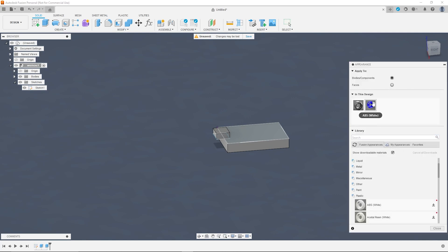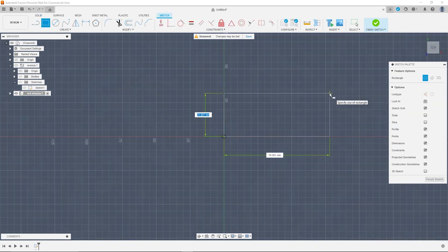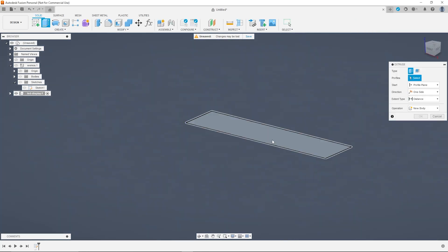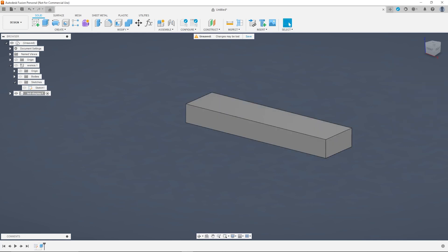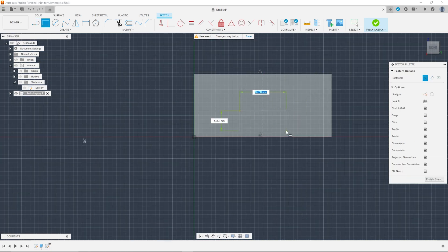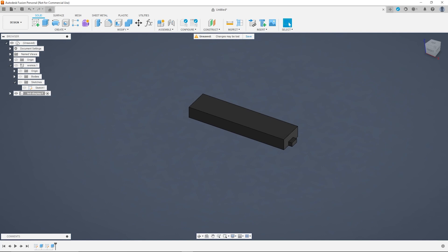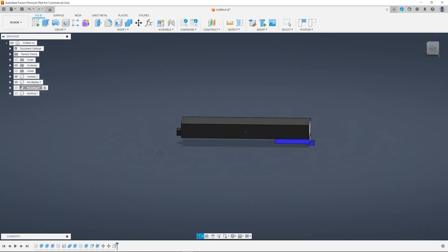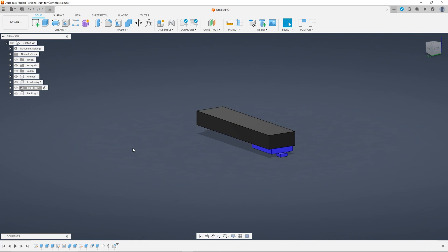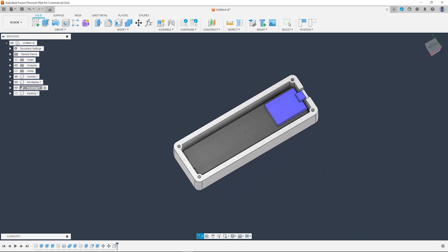In order to do this, I used my calipers to get some really accurate measurements of the overall features. The key here is not to get bogged down in measuring really fine details, because on a practical level they won't make a difference — you just want the overall architecture of the components, for example the overall shape of the LED display. With regards to the Wemos, you also want to know where the USB-C connector goes. Once I had modelled the components, I arranged them in the rough orientation and position I want them to be in real life, and then I modelled a front case to go around the front parts of the components.